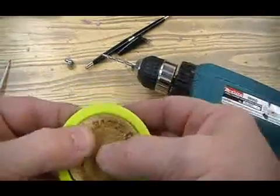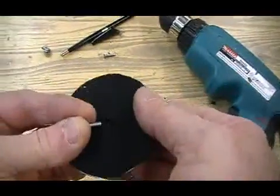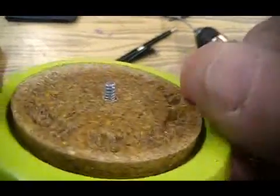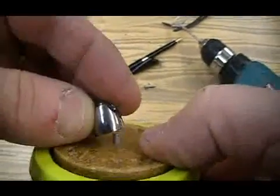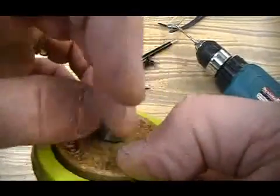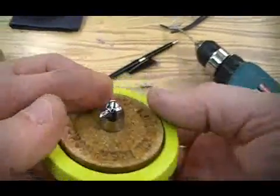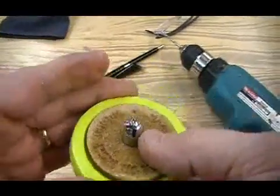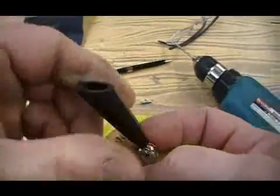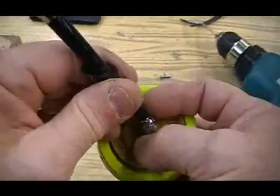Line up the holes, and then grab the flathead fastener, the machine screw, place it through, hold it in place. You see there are just a few threads that are sticking up above the surface of the insert. On that we're going to spin the base, the pen base part, and tighten that up. And then you're going to raise up that little threaded portion so it can receive the ferrule. The ferrule is the part that the pen will rest in. Wow, it looks great. Very nice.